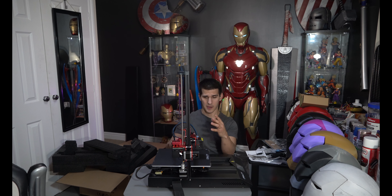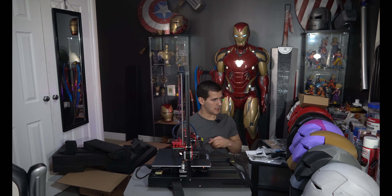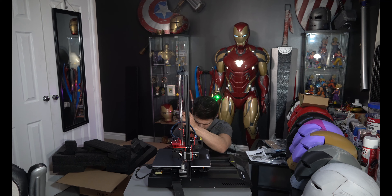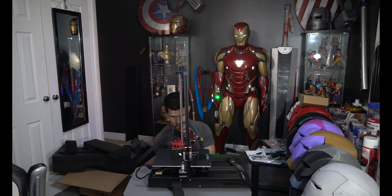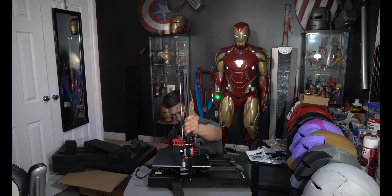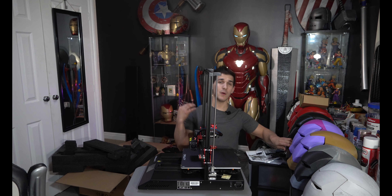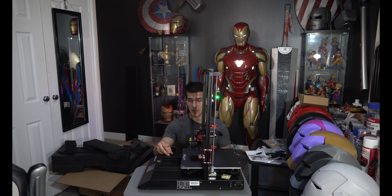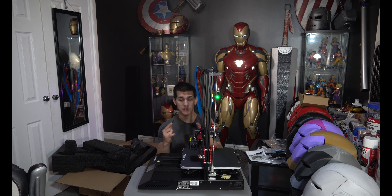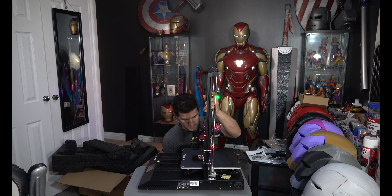What I've done is actually tilted some of the printer off over the edge so I can get the screws up underneath it. When building this and putting all the screws in, I would very much suggest hand tightening everything and keeping it a little loose. Don't tighten them up all the way at first — this way you can still move everything around just a little to get the proper alignment.